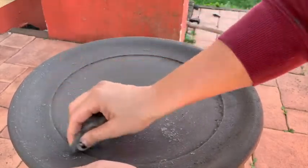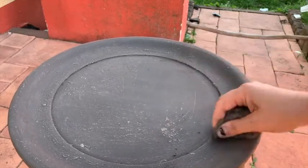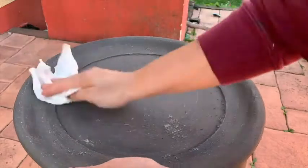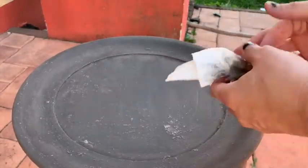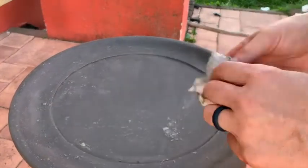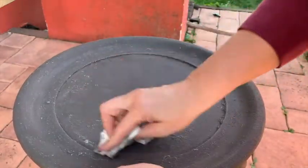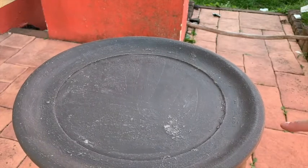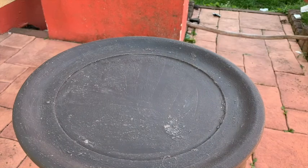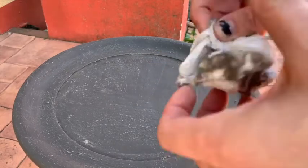I have a damp paper towel and I'm just going to wipe all this excess dust away. You can also use a chip brush, but I'm using a damp cloth because I want to see what it looks like without the dust — sometimes the dust makes it look lighter than it actually will be. This is how we start exposing that bottom layer of the Sea Spray underneath. I'll do the 120-grit and steel wool on the entire piece, then wipe it down with a damp rag and move on to the next step.